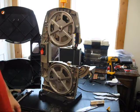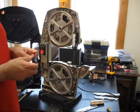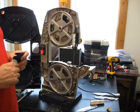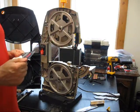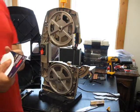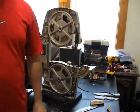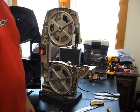Thirdly, the metal blade I bought is from Bosch — it's specifically a metal-cutting bandsaw blade. The blade length for this saw is 59 and a quarter to 59 and a half inches. Bosch was one of the only ones that had a metal blade that fit this saw, because at Home Depot the smallest one they had was a 62-inch, and it does not fit. Kind of handy that they sell the saw but don't have a blade that fits it.